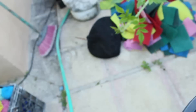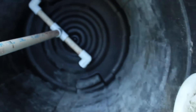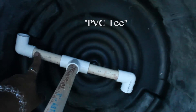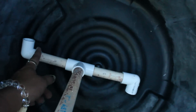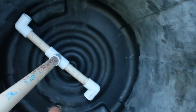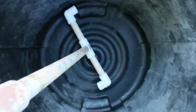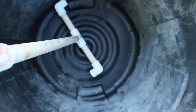The water is going to go through the pump. It goes through the pump and in here, goes down, and then there's a T-connector right here. This T connects to two other pieces cut from the same long piece, and then I have two more L's, one going this way and the other going the other way. This creates a circular motion when the water goes through, which also helps with debris so it settles down and doesn't go straight back up.